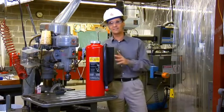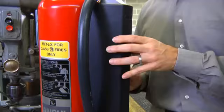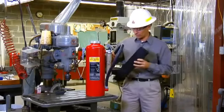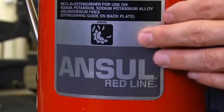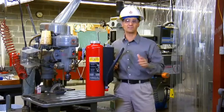The components of the extinguisher consist of a dry powder shell. This model also comes equipped with a cartridge which holds the compressed gas that expels the dry powder agent out of the extinguisher. Notice the red handle on the fire extinguisher. In addition to the Class D nameplate symbol, the red handle also indicates that it's for a special application.